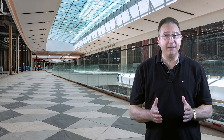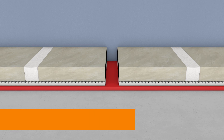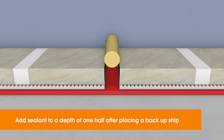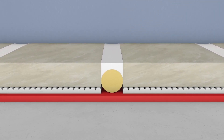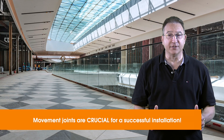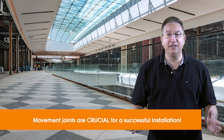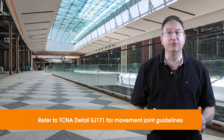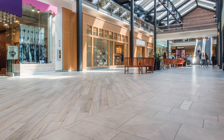It's also helpful to tape the top of the tile on either side of the joint for easy cleanup. Place the compressible backup strip in the bottom of the joint, then add the sealant above it. The sealant should adhere to the sides of the adjacent tiles, but not to the backer rod or substrate. It's also acceptable to use a preformed movement joint in lieu of sealant. Placement of movement joints is crucially important for successful tile installations and to maintain a good reputation for our industry. They are also a requirement of any Custom Systems warranties. I urge you to read and refer back to EJ-171 in the current TCNA handbook for full information on installing movement joints.